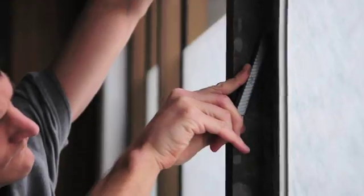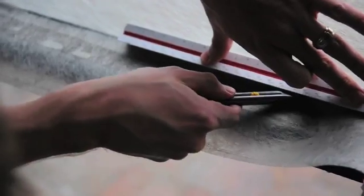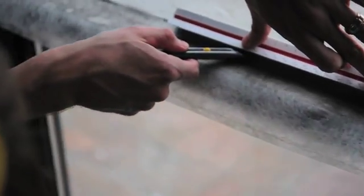So using a straight edge, we cut the Gecko to get a nice clean line to remove the excess Gecko and reseal it to the glass. And then we also show the process of correctly breaking a blade and talk about how we frequently need to swap out the blades after making our cuts to make sure the Gecko cut remains clean.